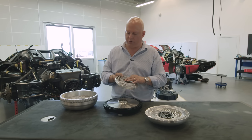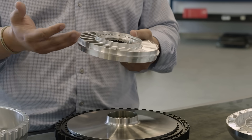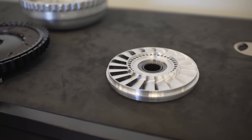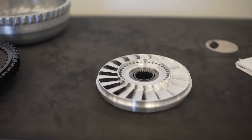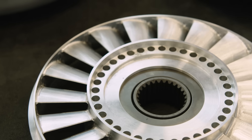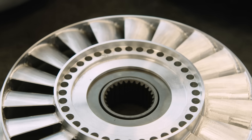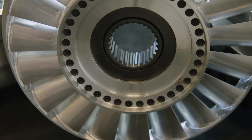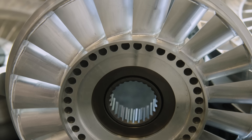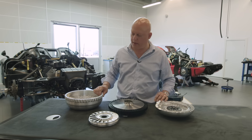This is the stator unit, which also acts like an oil gear inside the torque converter. This had to be designed very carefully to have as low a stall point as possible. As you can see, it's all beautifully machined aluminum. Compared to its size, we have more surface area for torque conversion, more fins, and much less weight.